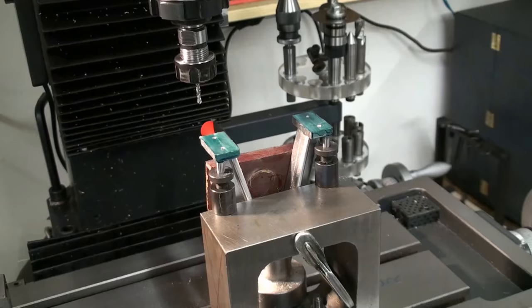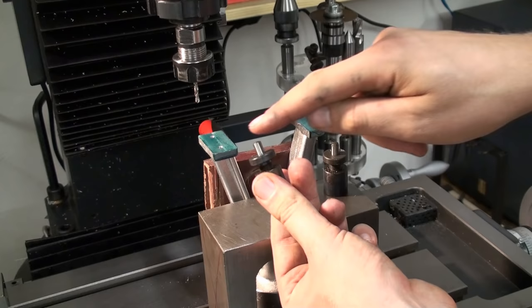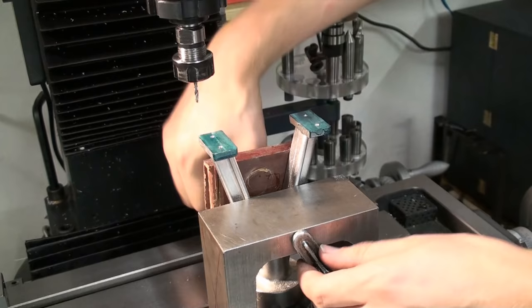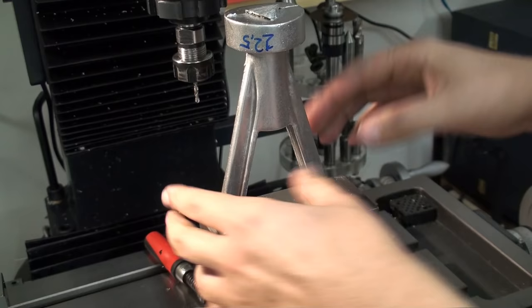Okay, let's take out the screw jacks. And these are normal screw jacks, but they have a 6mm bore on the top where a dowel pin can be put in. The dowel pin has a rounded top, and this gives a nice point support for rough surfaces like this casting. And the Bessey clamp. And there we have it. We have the bottom surfaces nice and square.